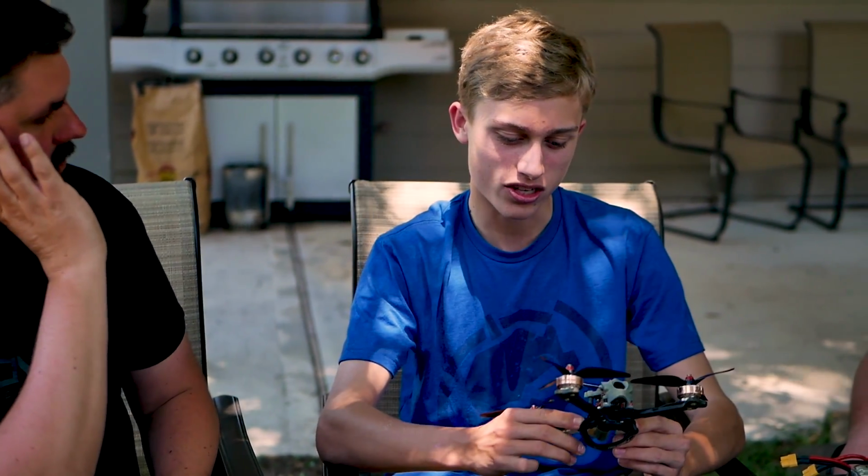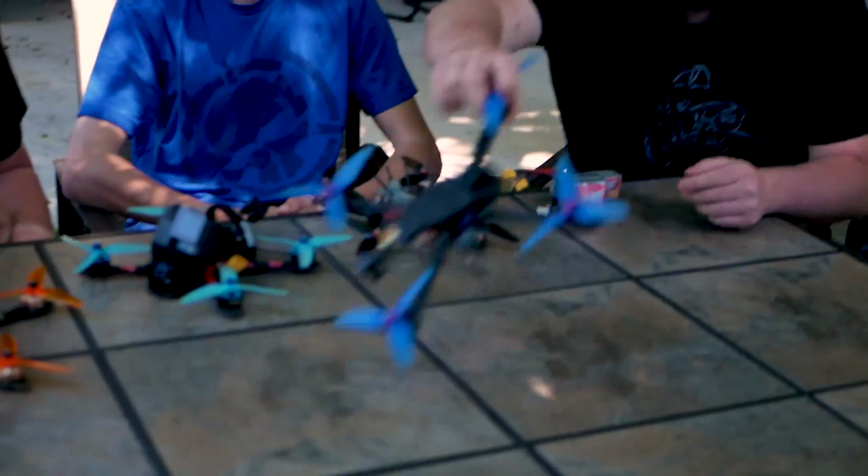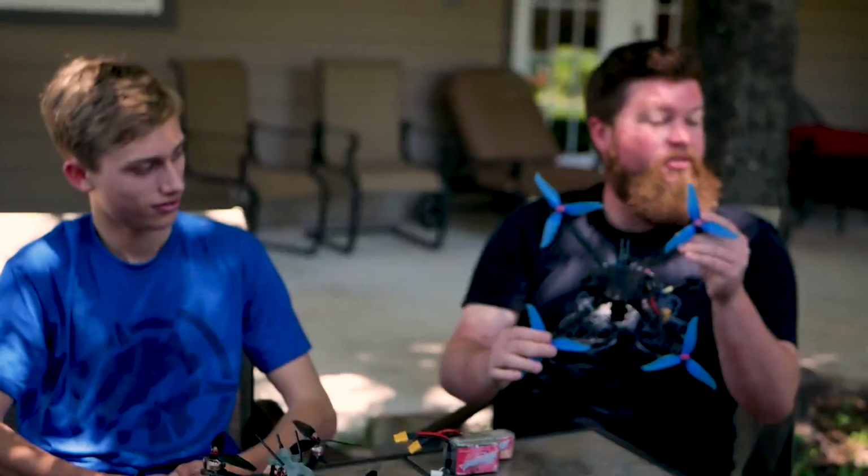I think maybe I just have a different note to why people like the Stretch X, and it's not what people thought it was. The reason people are liking Stretch X is they're actually increasing their footprint, and this is something I've tested. If you look right here at this quad, this is right now a 7-inch quad running 5-inch props. That's sort of silly. That is not my normal platform, but this is sort of an experimental point.